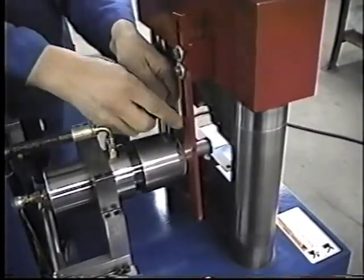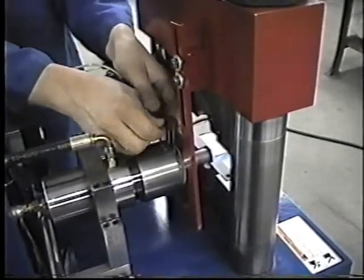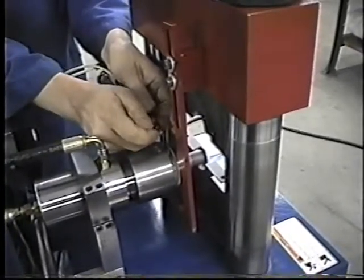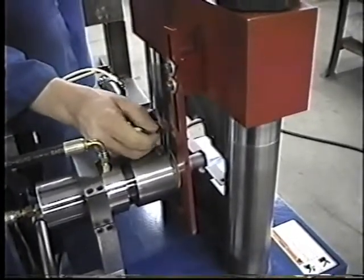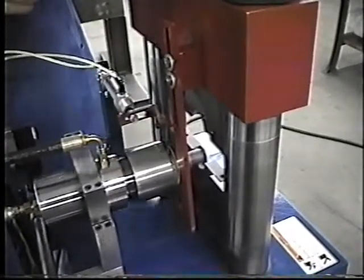And this little arm is used for rotating the tool, so that once you make a form, because the segments do leave a gap, it'll rotate and hit again in the second stroke, and when it does that, we pretty much have the 360 degrees covered with the bead.